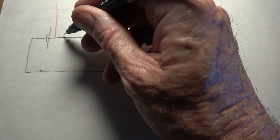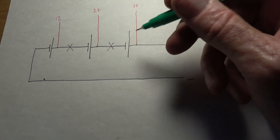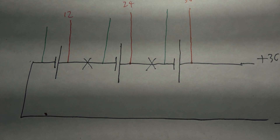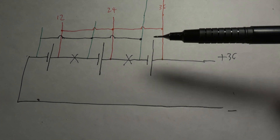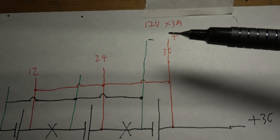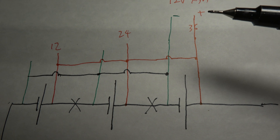What you have to do is cut here and cut there, and then you can make a parallel connection. You can see you've got three separate 12 volt segments so you can connect them up in parallel. As you can see, we've now got three 12 volt panels in parallel, and that gives us 12 volts at three times the current we would have got at 36 volts. So you dig into the panel and try to do that, which isn't quite as simple as it seems, as I'll show you later. But that's the basic idea.